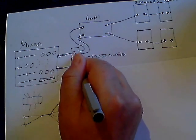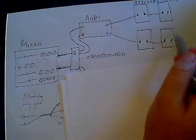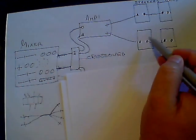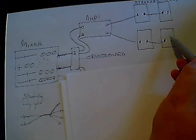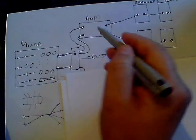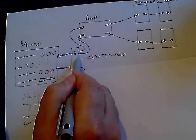and we're pumping out your highs through this. So you've got 4 speakers running at 4 ohms, just doing your highs and mids. Now you're not going to put these speakers under so much pressure. You're going to get quite a high volume of your high and your mids, and you'll be in total control because there will be a gain control on your crossover.